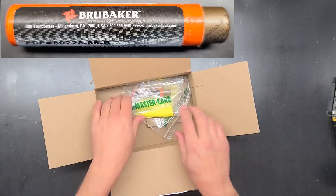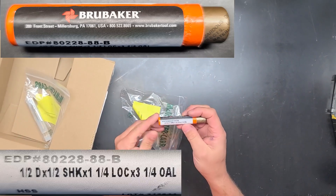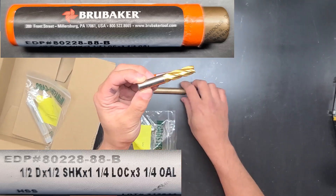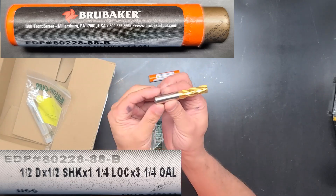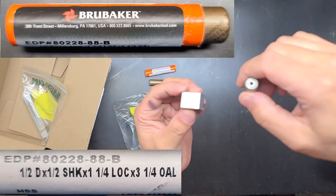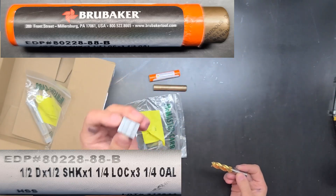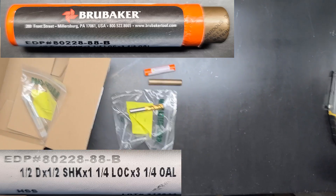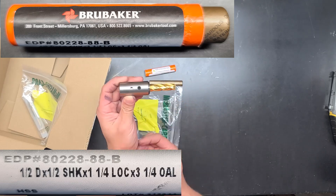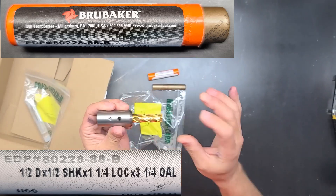Made in USA — a good American company. It's a high-speed steel titanium nitride coated square end mill, four flute, and that's going to be wonderful because it's been so tedious doing these journal boxes. Being able to take fewer passes and machine the ends is just going to be great. I got the longer end mill holder so that it correlates with the shorter shank on these half-inch ones — it bottoms out at just the right length. To be more precise, it's a one-and-a-quarter-inch length end mill shank, which is a perfect fit for this Sherline end mill holder.